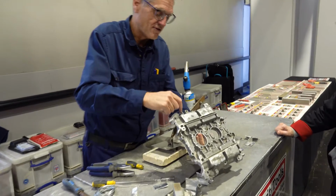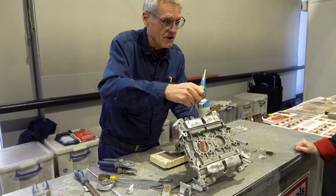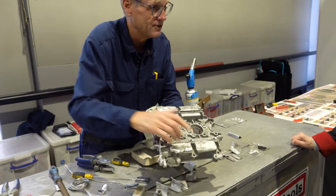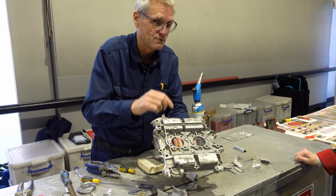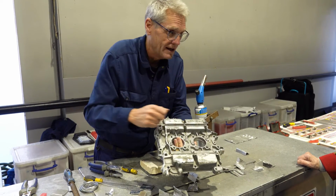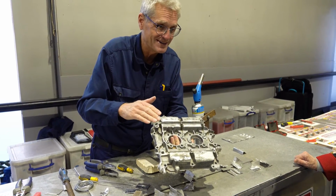You drill out the broken thread and plug it over steel and fill up with the melt, and stir so you're going to weld with the material. You don't have to drill and tap it. You drop a stainless steel bolt as the mold into the melt bath when it's warm with fluid. When it stiffens, it shrinks back so you can screw out the bolt, and it gives you a brand new cast thread. No drilling or tapping or helicoil. Did you follow me there?